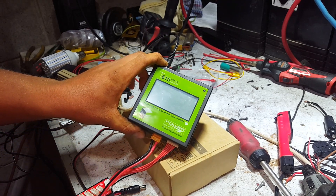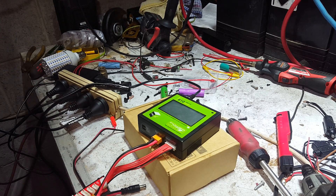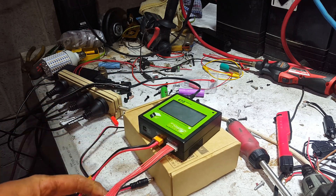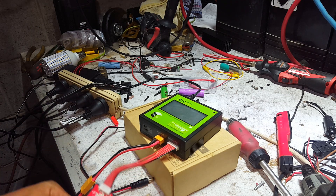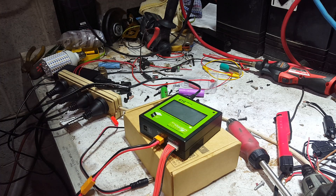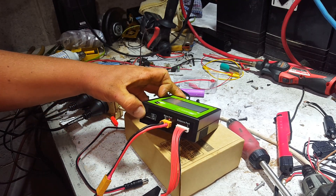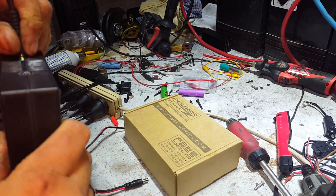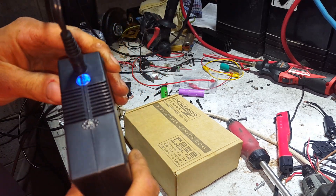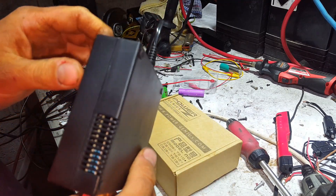It's a super duper everything machine — XT60 in, XT60 out for the main port. There's a balance port with a balance board that you plug in and then plug your balance leads into, which stops you risking bending a pin. There's a USB link, servo test pins, temperature sensor pins, 5mm DC input, and a nice little fan in the back. It's got quality control pass marks and is well vented, sitting on an aluminium backplane.